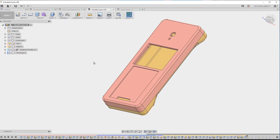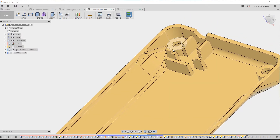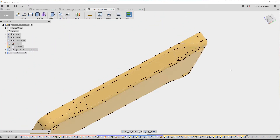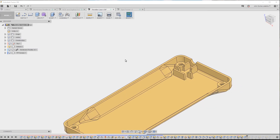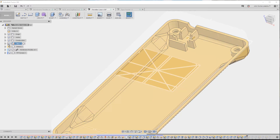One of the things I'm working on right now is the fit of some of the parts. If I turn the bottom off, you can see there's a place for screw holes to hold the top and bottom half together, and here's a little holder for a toggle switch. It's done this way with ribs for injection molding purposes, because if you have too much plastic on one side, you can end up with sink marks that mar the physical appearance on the outside.